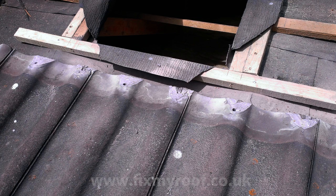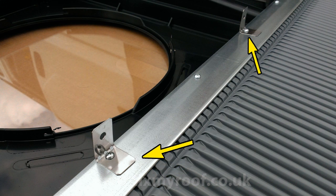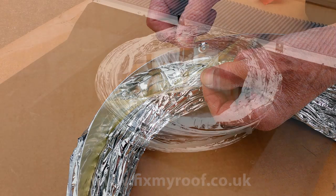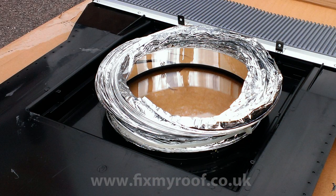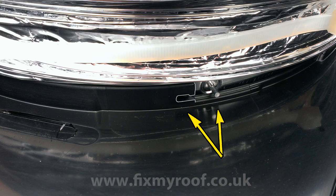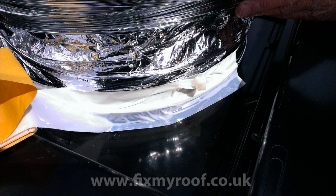Now we're ready to receive the window unit, so let's prepare it. Fold the metal tabs into position — these are normally screwed into the framework from inside the loft after fitting, but we haven't got access or physical room to do that. Now turn your attention to the flexible tunnel. Don't forget to peel away the protective tape at this stage. Place the tunnel into position making sure it's seated correctly all the way around, line up all the little tabs, then rotate the tunnel until the tabs are secured and the locking tab is clicked into the locked position. Using more of the malleable tape, thoroughly tape the tunnel to the underneath of the window unit — this will stop dirt and insects getting inside the tube later.